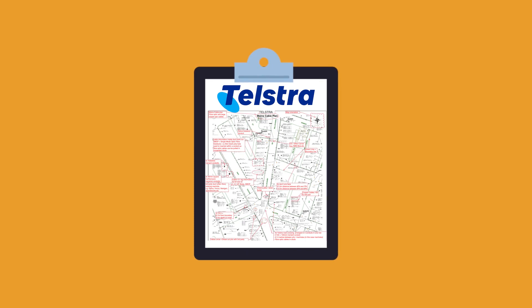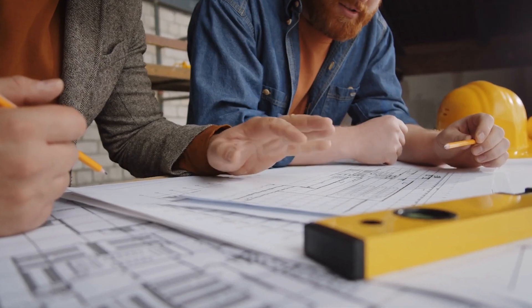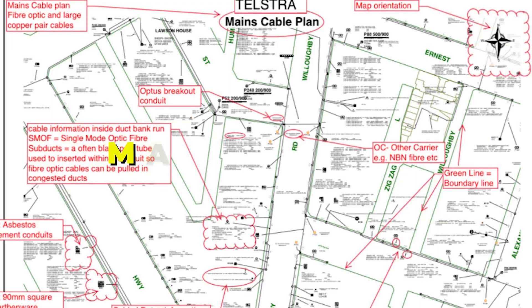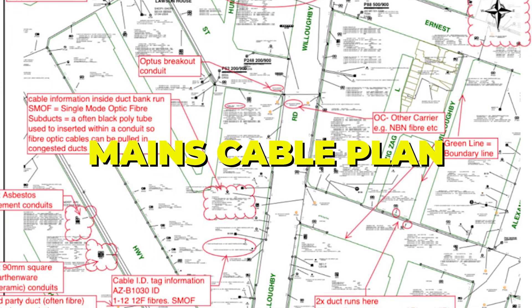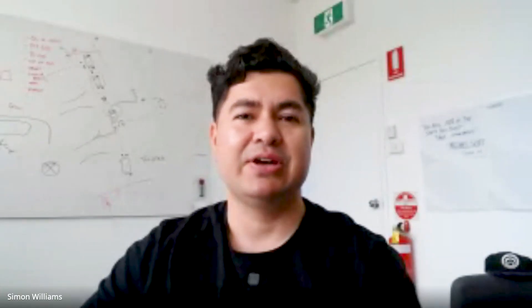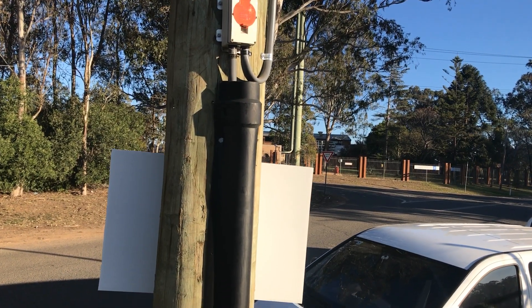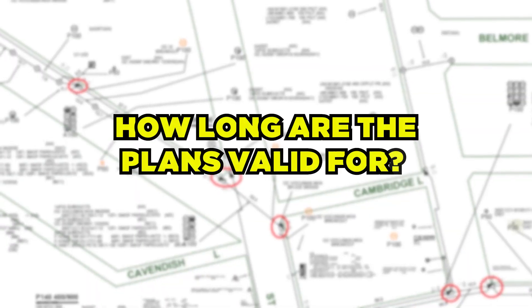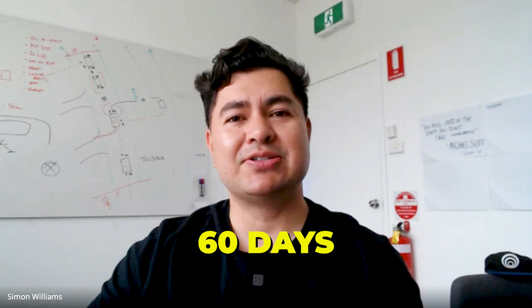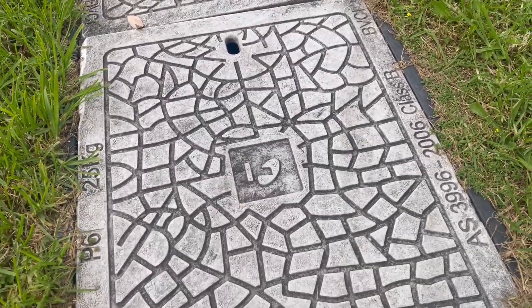What you get back is a mains cable plan and a cable plan — two sheets. Both sheets need to be read in conjunction so you know exactly what's been covered on the different pieces of paper. The mains cables are mainly the thing we're worried about — it's the fibre-optic cables, the large pair copper cables, and the stuff that's quite important. The cable plan shows utilities or underground communication cables leading to properties and the distribution network. The plans are valid for 60 days, though some before you dig plans are valid for 30 days and some 14, so be mindful and renew them every 60 days for Telstra.